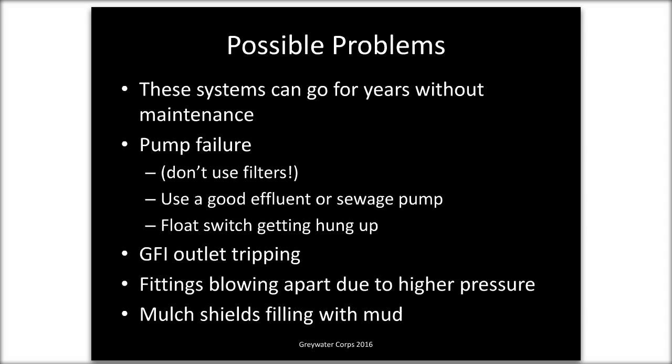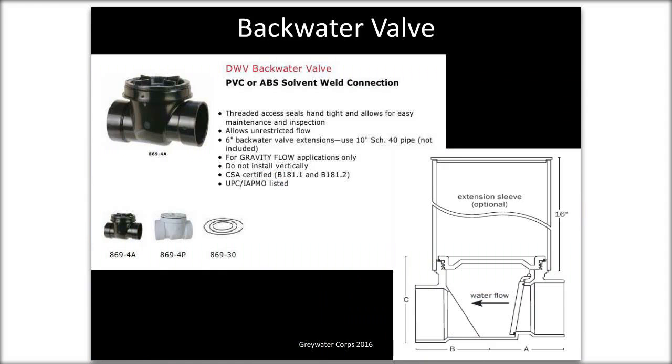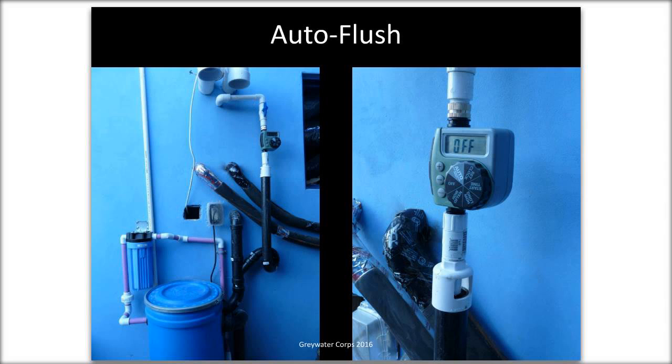Someone says, this is a good question, why do you need a trap on the line going to the gray water from the auto flush? So I could probably find a picture of that if I went back a ways. Oh, here's one. There is a P trap. So the auto flush goes down, there's a P trap at the bottom, and then it goes back into the tank. Gray water tanks, even super clean gray water systems, you don't want...